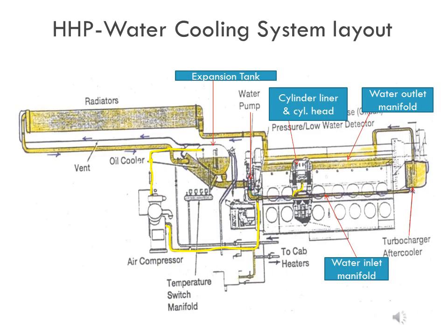Since the water inlet manifold is connected to the after cooler at the rear end, coolant coming out from the after cooler is also collected in the water outlet manifold at the top center of the engine. Coolant is then directed from the water outlet manifold to the radiator assemblies, where it loses its heat and becomes cool. The AC motor-driven radiator fan moves air through the radiator core.